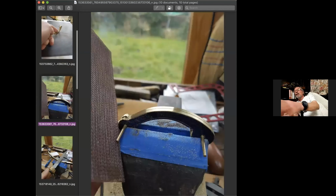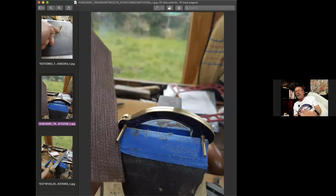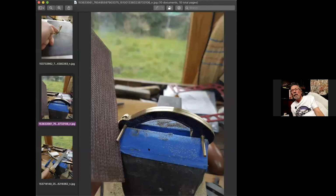These two on the outer sides, the left and the right arm, the main arms, are absolutely exactly the same. And they're no different to any other set of dividers, except they're a bit, you know, fancy. So they were done back to back in parallel, in tandem. And here you can see all I've done is basically stuck them together using the taper pins that you use for clock and watch making. They're just brass taper pins, and they just tap in, and it keeps the two locked together, just like that.